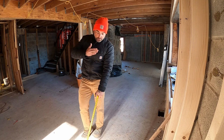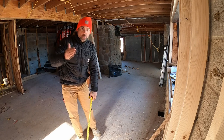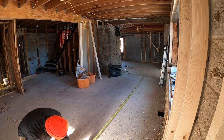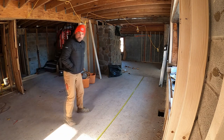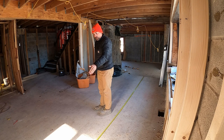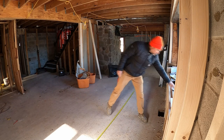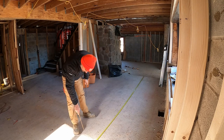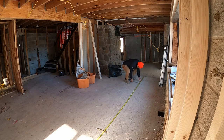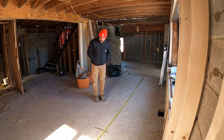When you're calculating that three feet of backup space for your chair that's going to be at your dining table, I go from the furthest point of any obstruction — so that countertop overhang would be the mark that you want to make. I've got 15 foot one inch of clear space from the edge of that step to the edge of my countertop overhang. I'm going to call it 15 feet for easy math. If we simply went three feet on each side, we'd be left with a nine-foot span — marking it out: 15, 14, 13, 12... one, two, three on one side and one, two, three on the other — here's my 36 inches. Right off the bat, in this particular circumstance, this is too close for me.